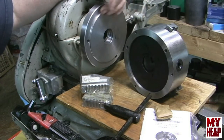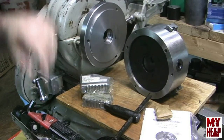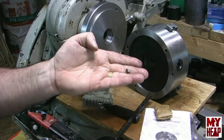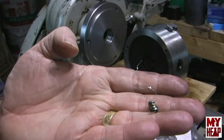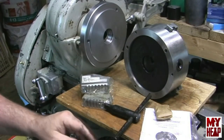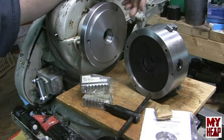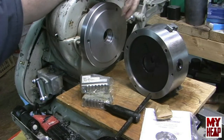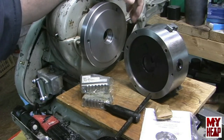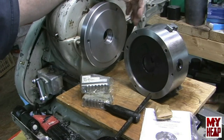This has been great. One thing I was surprised at — this is not cast iron, this is steel — and the chips I was cutting had a nice light straw color at a 25-thousandth depth of cut, which felt pretty good. I do think I may have chipped the carbide earlier when I was feeding the tool in. I'm getting to the point where I really need to grind some high-speed steel, because I need to practice that sort of thing.